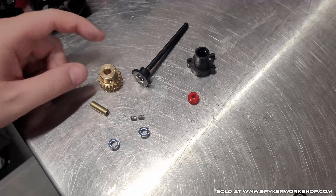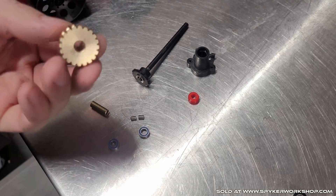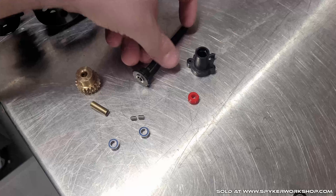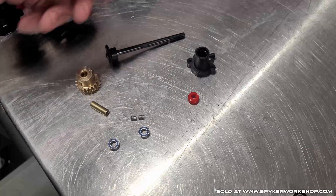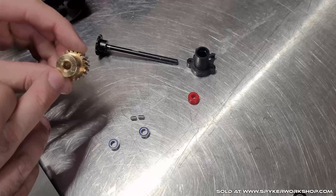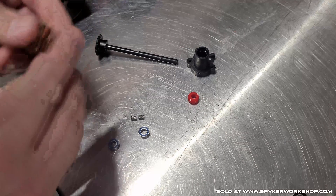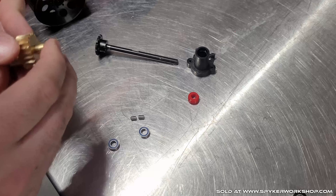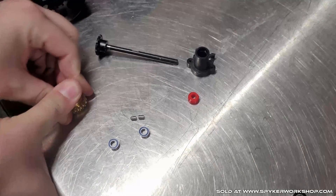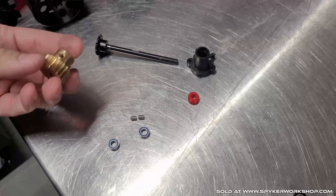There's a little thing here: I've ordered a lot of these gears for the new snowblower — they're all six millimeter diameter, but the Blizzard uses a five millimeter shaft. So as a workaround, instead of ordering these all in five millimeter, it will come with this little tube. This can be pushed in here — it might take a little bit of force, but get that in there flush, and that basically turns it into a five millimeter.